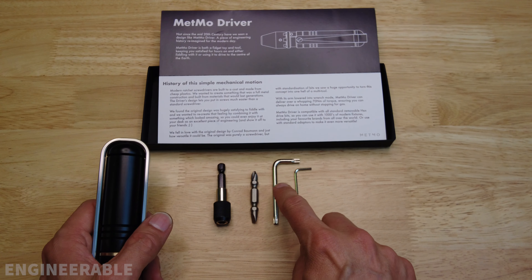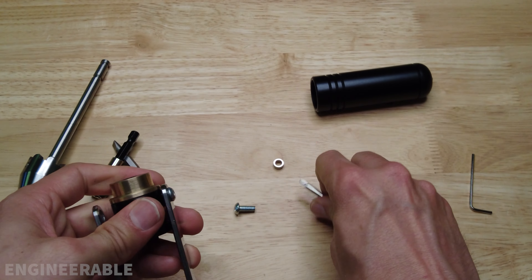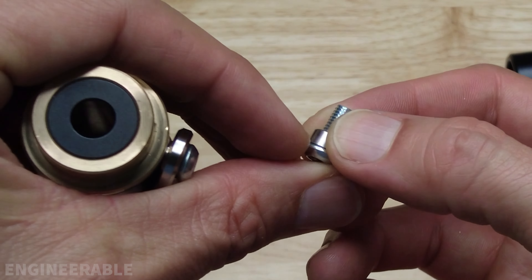This is interesting. There are holes in here — the only thing I can think is maybe those holes are used to balance the driver, because there's a cutout over here but there's still material here. This handle actually rotates on a bushing, so the screw is tightening the bushing down. The screw is not tightening the handle down directly, so the screw is not going to directly affect the tightness of the handle. The handle tension is kept because it's not closed all the way — it's opened a little bit. When you tighten that screw, it's the spring tension that keeps the handle from just flopping around.